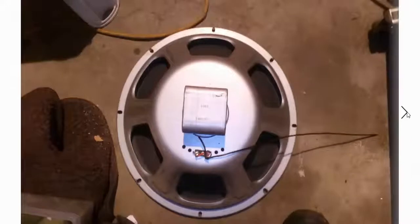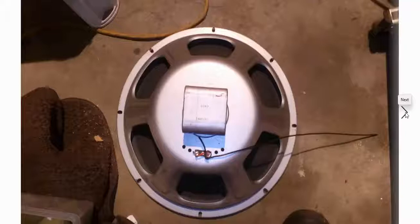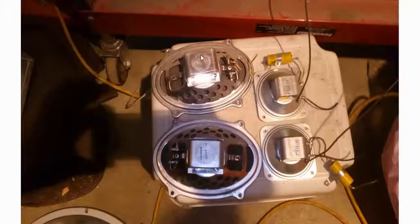When I opened up the cabinet, what we had is this really nice big 10-inch woofer, right? You don't need a big magnet on it because it's only going to operate around 10 watts or so. So the woofer cone was actually in exceptional condition, considering it was probably 50, 60 years old. Oh, at least maybe 60, 70 years old. It had what we call the mid-range speakers. They look like car speakers now. And then they have a couple tweeters, and you got your filter caps on it. So I thought, hey, this is a pretty good basis to start.